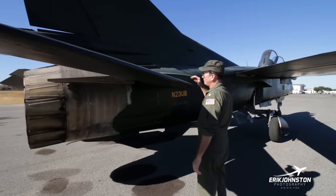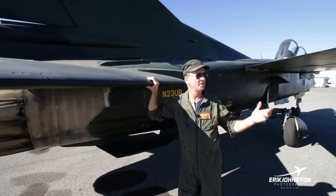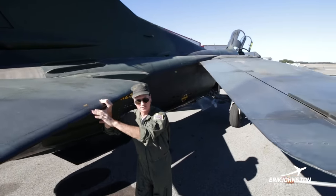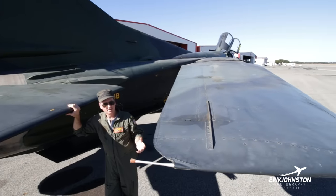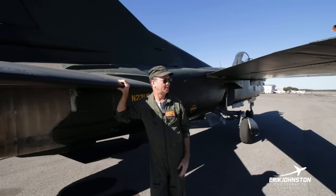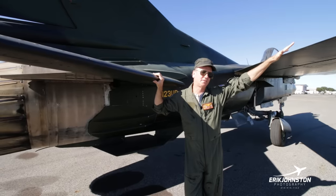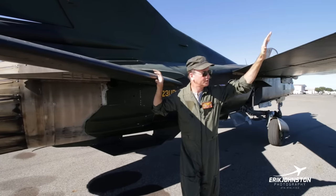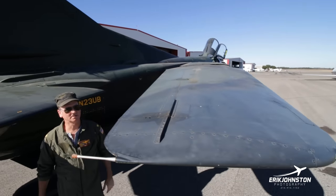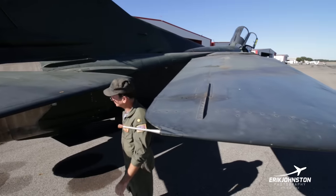So for turning the airplane, when the wings are at 16 and 45 degrees, it uses a combination of flaperons and stabilizers to turn the airplane. But when you go to 72 degrees totally, then it just uses the stabilizers themselves. This has flaperons, it doesn't have ailerons. So it has leading edge devices and flaperons and flaps in the back. So a lot of stuff going on with the wing, even though it's moving, it still has all the cool control surfaces.